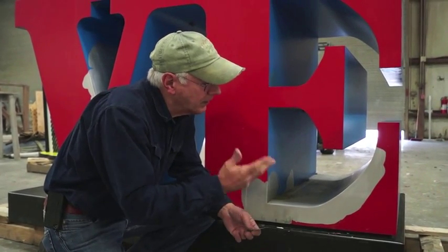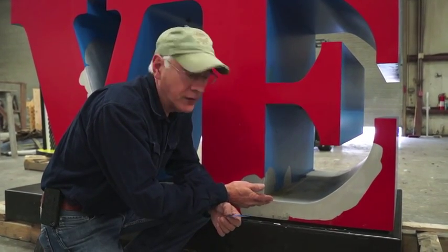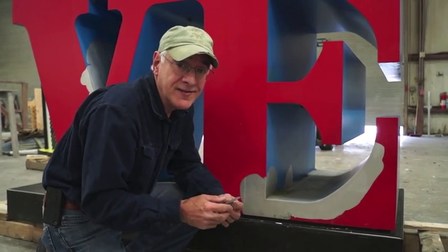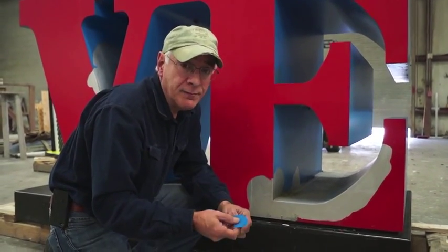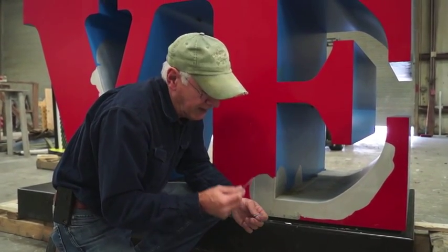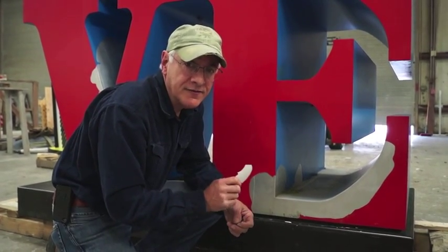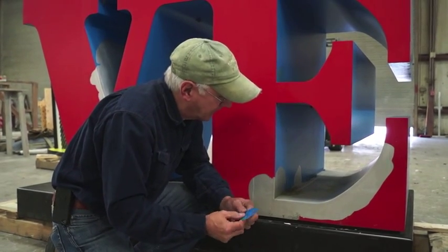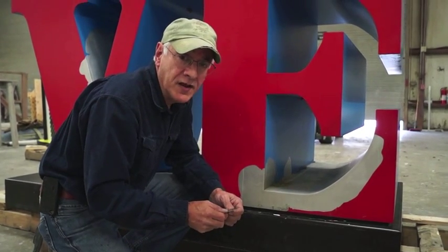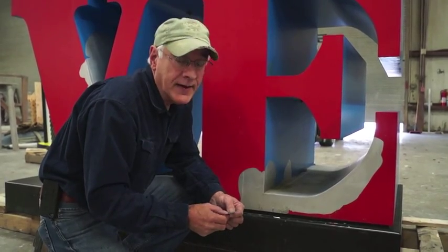So that has to be done within 24 hours of cleaning the oxides off the aluminum, and then within 2 or 3 hours after that, it has to be resealed with another kind of paint, an epoxy primer, whatever kind of primer that you want to use. If you get those two steps done, you're going to have a fairly successful paint job. But this is what the art world has accepted as standard quality for many, many years. And it's really kind of shoddy.